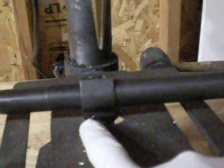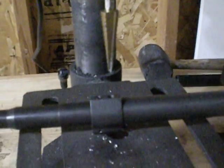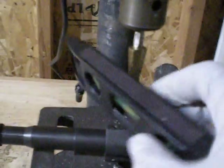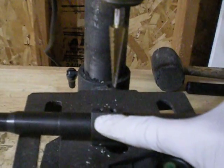You want to make sure that your orientation is correct, that you've got the smaller hole towards the front of the barrel. If it's flipped around, you're going to have problems. So make sure of that, go ahead and make sure it's level across here. I usually go ahead and set the set screw right here as well, the one that's still in there.